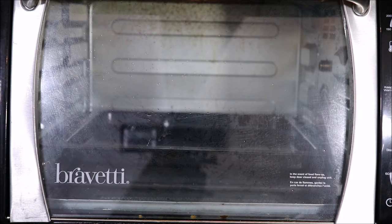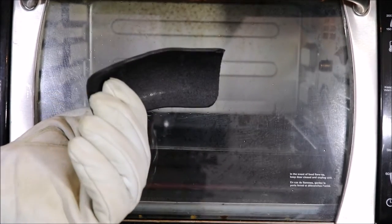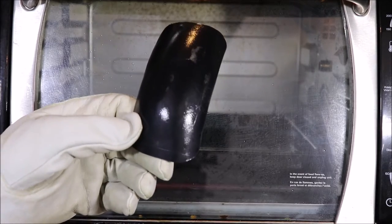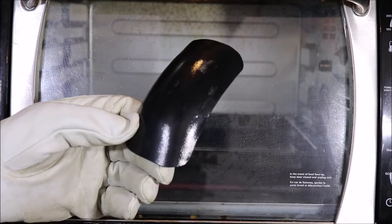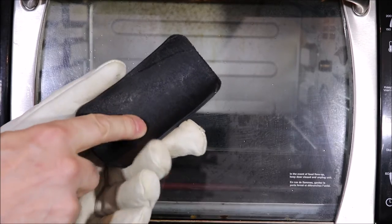I couldn't finish this video without showing you how Kydex reacts when you put it in a toaster oven. This toaster oven is set at 350 degrees — you might hear the timer in the background because it needs to be on the timer for this to work, and it's on bake right now. They suggest you don't go above 375; if you get above 400 degrees the Kydex will start to blister. Here's a piece of leftover Kydex — this is 3 millimeter, which is all you need. It costs about $23-24 for a 22 by 22 inch sheet, so it's a low cost project.